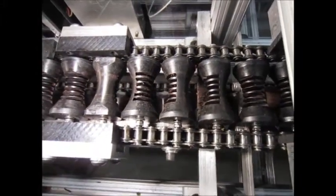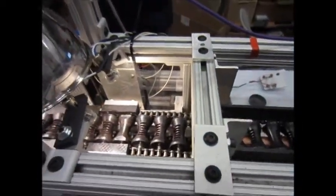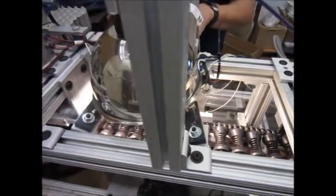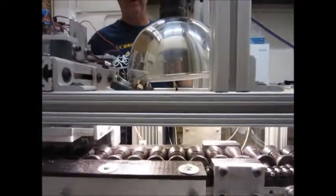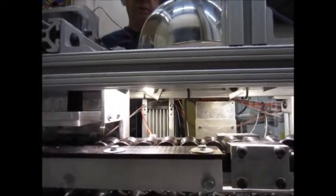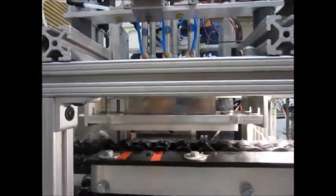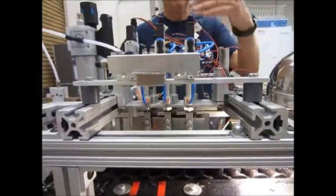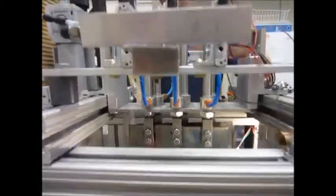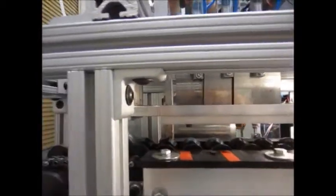When it reaches this portion of the capper, the roller stops spinning, and the berry passes beneath a camera. The camera takes a picture and sends that picture to a computer, which processes the image in just a matter of milliseconds and determines which way the berry is pointed, and if it is in a good position to be cut, which of six possible guillotine-like blades will come down.